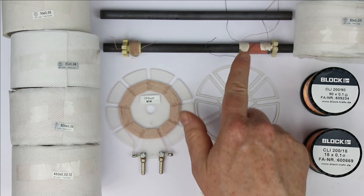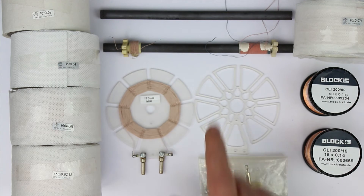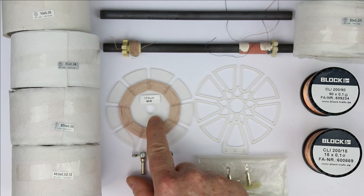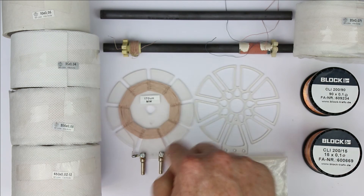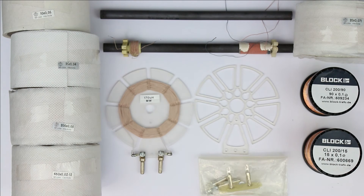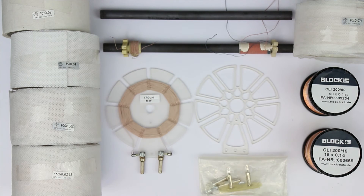To get higher quality factors — which is always what you desire — the next best thing is these spiderweb reception coils. You can make medium or long wave reception coils on this template. This one here is for medium wave. By the way, the coils are intended for a tuning capacitor of between 200 and 300 picofarad maximum capacity.